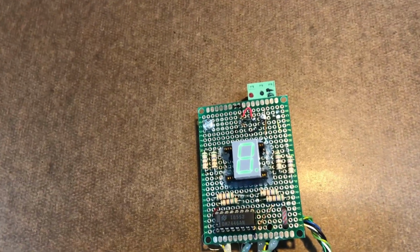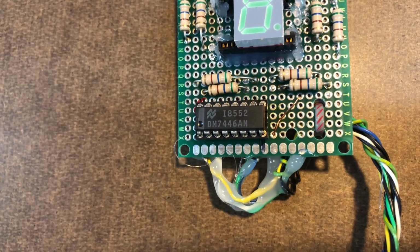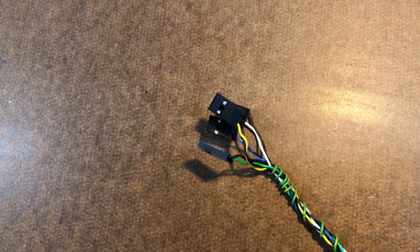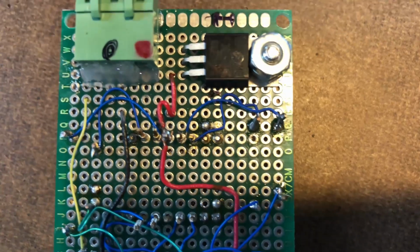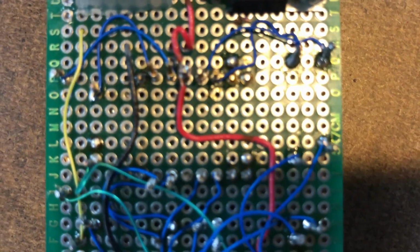And the new display board is here, and it has all of the components mounted. It's got the power connector, it's got the chip installed in the socket, the 7446 decoder driver, and I made this cable. I showed you this in an earlier clip, and it's got the connectors on there for connecting to the servo driver. And the back of the board does not look too bad. What I've done for all the signal wires is I used standard wire wrap wire, and it made things pretty clean. And I like using the stuff that's already stripped. It's 30 gauge wire. Now for the larger wires, for the 5 volts and ground, I use telephone wire. That red one is a +5, and that black one is a ground.